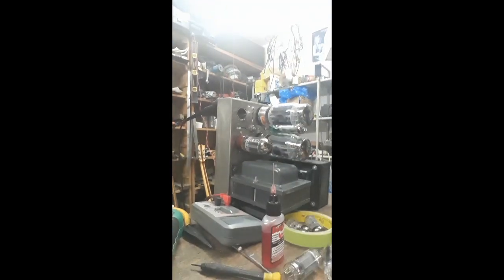The truth is, I put in the tube rectifiers, and I made quite a fuss about leaving the options open between tube rectifier and solid state rectifier, right? But the truth is, I think that when I bias it up, I realize that I'm kind of horsing around and messing up the whole thing. These aftermarket Joe Curcio boards really are meant for solid state diodes, and all of their operating voltages are based on that.